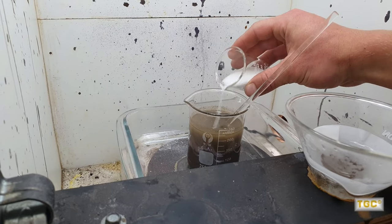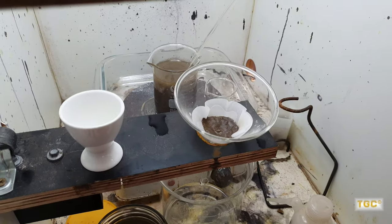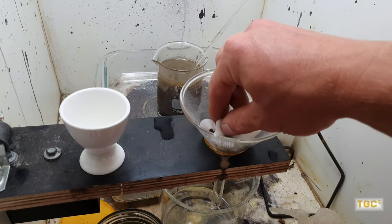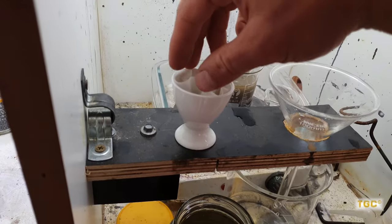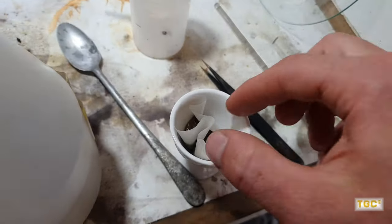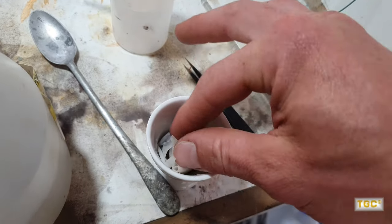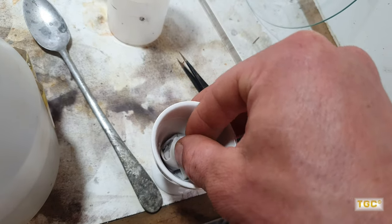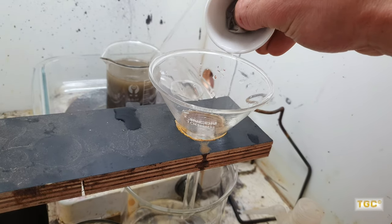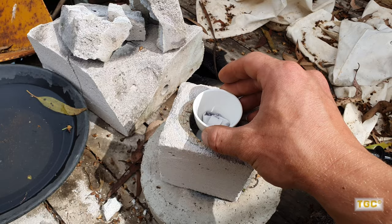Before we wait, I'll add some more sugar to the silver. There's definitely something happening back there, but it's taken a lot more sugar than what I was expecting. I've rinsed our gold off about a dozen times now, so we're pretty good to go. Let's take it and drop it straight into the crucible. We don't want the water to splatter up any gold and spit it out of the crucible, so we'll tuck this over. Squeeze out the rest of our liquid and she's good to go in the furnace. We won't add the borax yet — we'll wait until that paper burns up a bit before we do that.